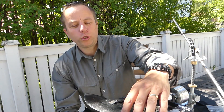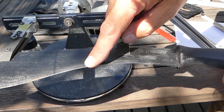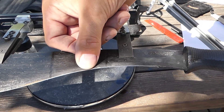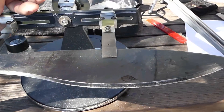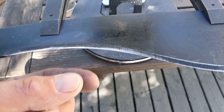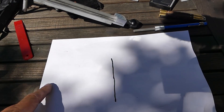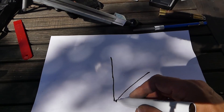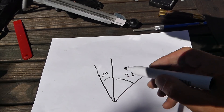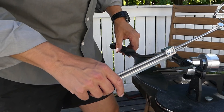I've sharpened the 22 and 23 degree portions of the blade and a couple of observations to make. The grind was obviously done by hand originally because it's very uneven. On this side we've got a much shallower angle on the original bevel. I'm just putting on a secondary bevel — you can see where the polished steel is. On the other side of the knife there's much more polished steel, so the stone is touching much more of the original bevel, showing it's an uneven bevel. One side is about 22 originally and the other is shallower, around 20. Just finishing up the 24 degree area with the finest stone — it appears to be coming up sharp.